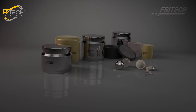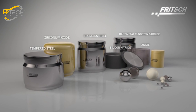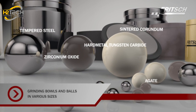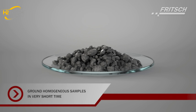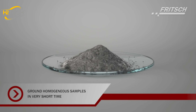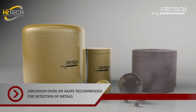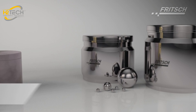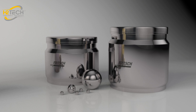To avoid the risk of contamination of the samples with undesired abrasion from the grinding parts, we offer grinding bowls and grinding balls in eight different materials for the Fritsch Planetary Mills Classic Line. Please note, the materials of the grinding parts must always be harder than the material to be ground. For example, if you would like to prepare a soil sample for elemental analysis — analyzing the samples for heavy metals such as chromium, nickel or cobalt — we recommend grinding parts made of zirconium oxide or agate. If you would like to analyze other elements like calcium, grinding parts made of steel can be used instead.